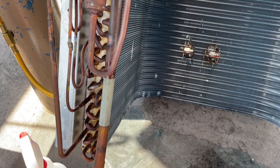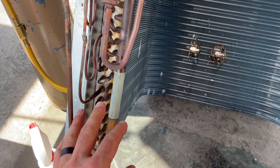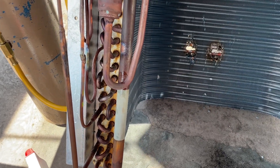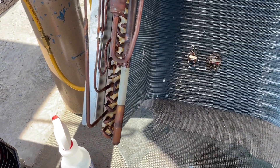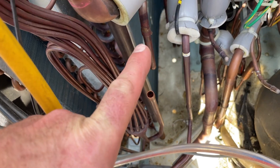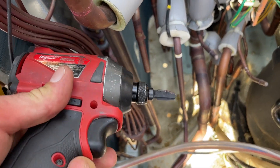There are a lot of systems out there running with removed circuits, and it's not ideal. The bottom circuits tend to be more important for sub-cooling and things like that. But this system has such fine control over refrigerant that at the end of the day it's going to be fine, and the customer will most likely decide just to replace this coil. I mentioned unbrazing this earlier, but cutting it and using a spin swage is a good option as well.